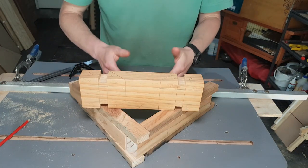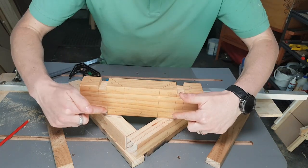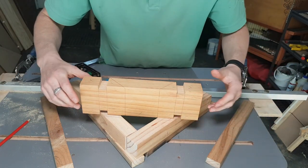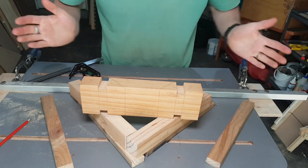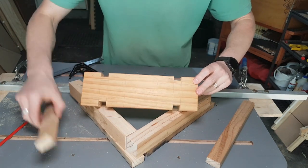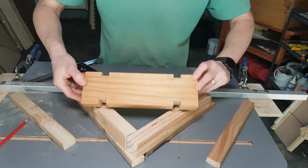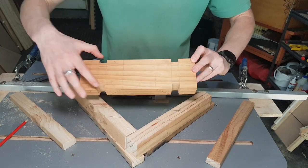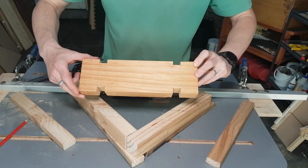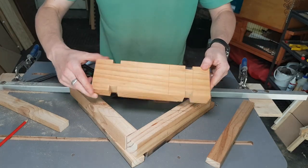This is how the brace is going to sit, obviously down lower in there. So as long as I cut the mortise there it'll sit perfect. I don't even have to worry about a second cut — we can just trim it down and the depth is the depth of the outside pieces. These little bits in there from the wine rack are all going to go anyway and this piece in the middle will end up being the tenon. Let's see if that works.